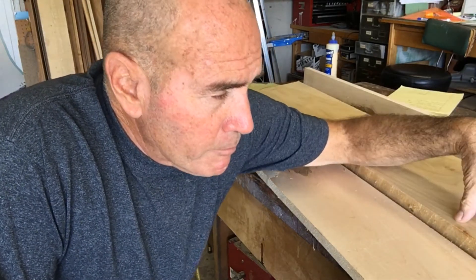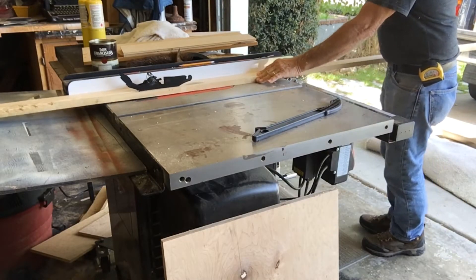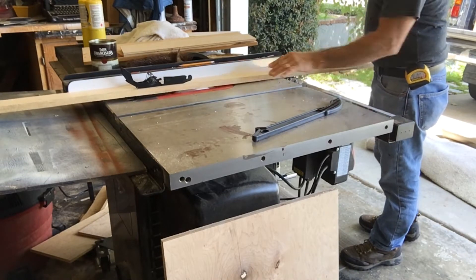Assuming that you're doing a traditional cabinet with a face frame on it, you need to make a choice about your face frame material. My cabinet is going to be painted, so I can use a paint grade material. I have two suggestions: poplar or soft maple are both good choices. Poplar is softer and less expensive with a green tinge, but that doesn't matter since you're painting it. I'm going to use the soft maple, which is actually quite hard, paints up nice, and doesn't dent quite so easily.